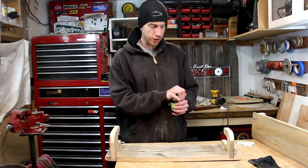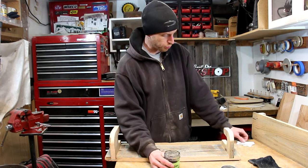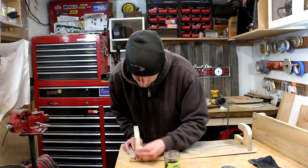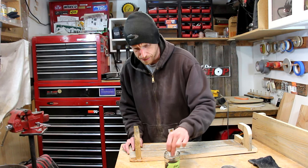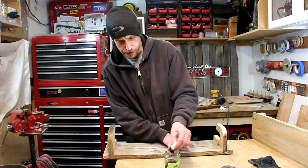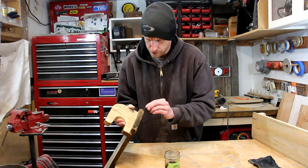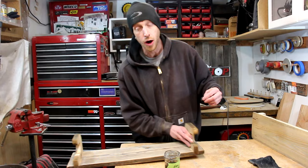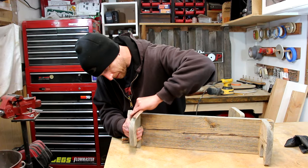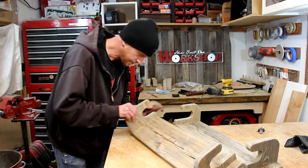Now that I've got it roughly sanded, I'm going to try to make these fresh cut edges blend in a little bit more. Since the wood's got a grayish weathered look that we all like about barn wood, I've got some gray Transfast wood dye. I'm going to go ahead and dye the edges of this gray — hopefully that will help everything blend in. If it doesn't look right once it's dry, I'll just sand it off. This is a water-based dye, so it's going to raise the grain a little bit — I'll knock that down once the dye is all dry. I'm going to let this dry overnight. Now that the dye has completely dried, I'm going to just break the edges with some sandpaper and also sand back a little bit of the dye so some of the wood grain can show through just a little bit more.